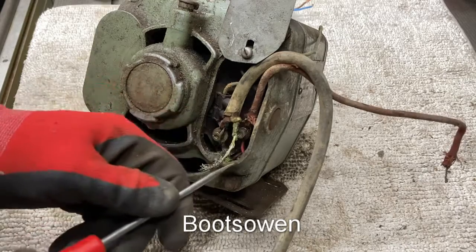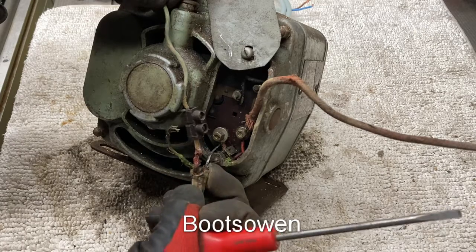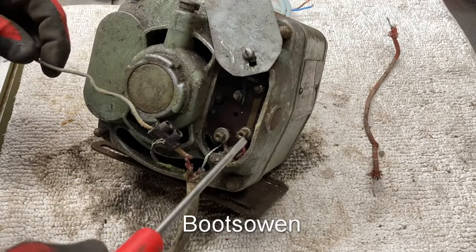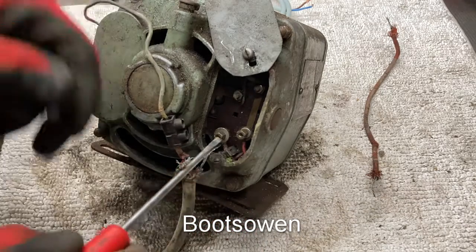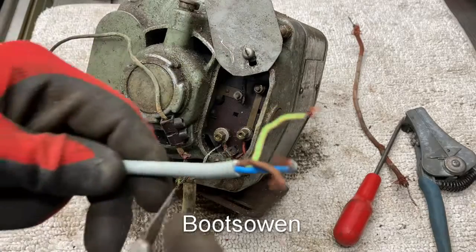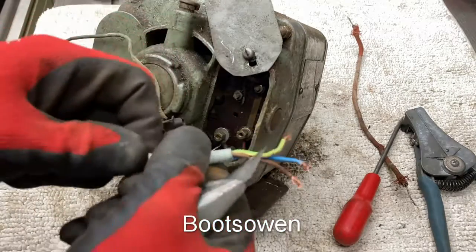Green — that's loose. I guess it's loose because it was on there. Okay, red. So that's all really awful stuff — it's touching itself. That's neutral black to the frame, no good. That was live and this was neutral. That wire was pretty bad. Bad's the only word for it. Awful.